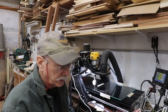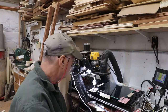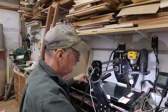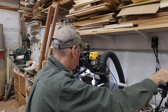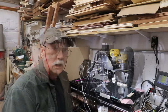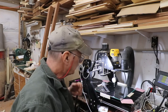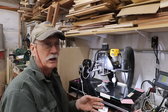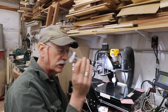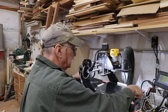Most of this will be time-lapse because it's kind of boring. I've got a lot of work to do here, I'll come back to this and we'll start filming again. Well, that took a while, but I've pretty much got it indexed now — it's as flat as I can get. There's a slight imperfection, irregularities in the glass, even though it's a three-sixteenths piece of glass. But now I have to remove that dial indicator and put in my angle indicator.